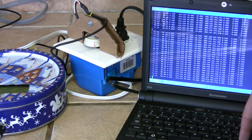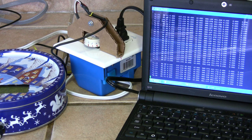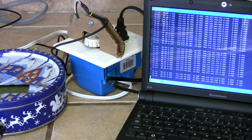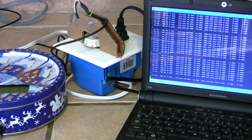Now that we have a temperature sensor and a way to control the crock pot from our code, we can start trying to understand the system we are trying to control. The first thing we did was try to control the system manually, basically using our brains to close the feedback loop and try to keep the water at a certain temperature by actuating the servo. While this was a fun game to play, we learned that the system is really hard to control.